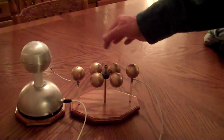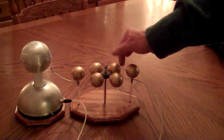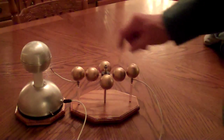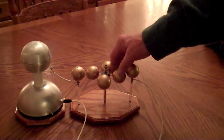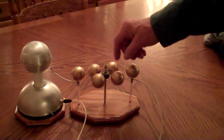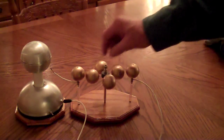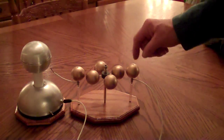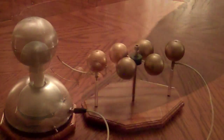These will initially be uncharged, but as the generator charges up it will draw the balls to try and equalize the charges. As that happens, a little spark will jump between them, making the ball the same charge as the terminal, which causes it to repel. Then it's attracted to the opposite side, where another spark jumps, and so on — that's how the motor keeps spinning.